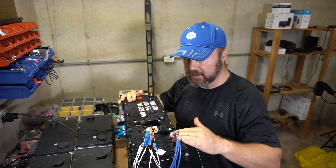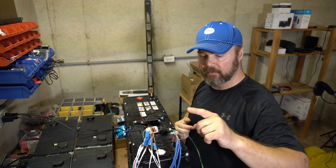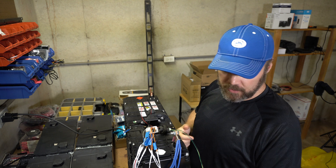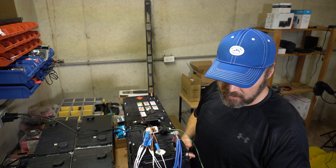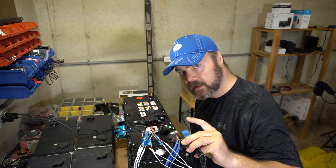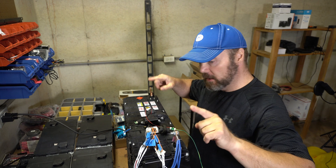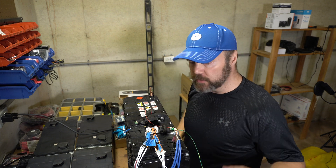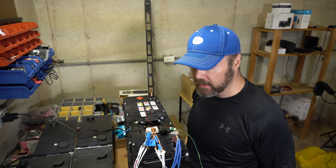This is a 24-volt battery. Before I changed the setting — when it was still on 16S but hooked up as an 8S — it was only showing about 20 volts at the C-minus terminal. Point to point I was getting 24 to 25 volts, but down there I was getting 20. As soon as I switched it to 8S, it read 25 volts. So everything looks good — it's balancing.